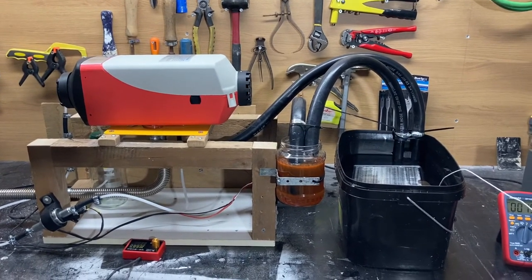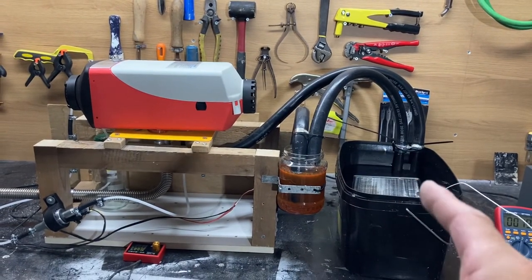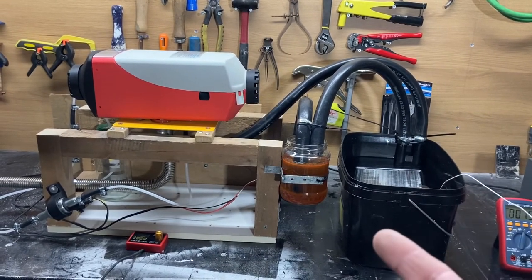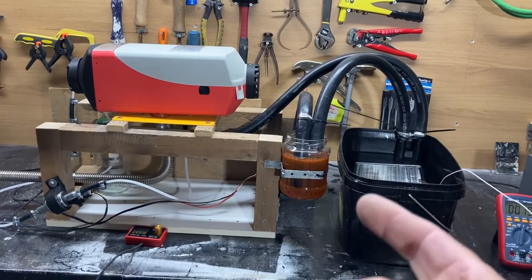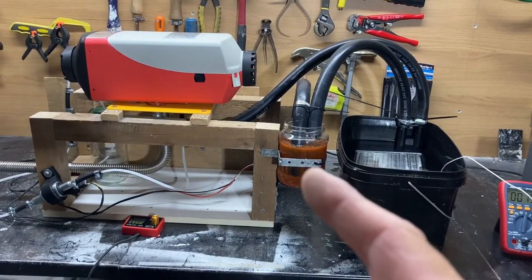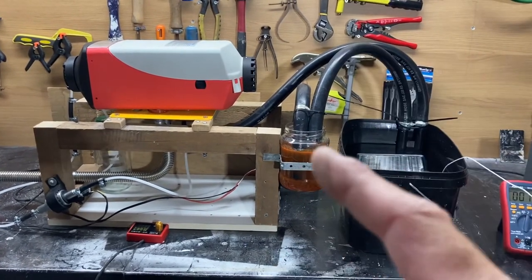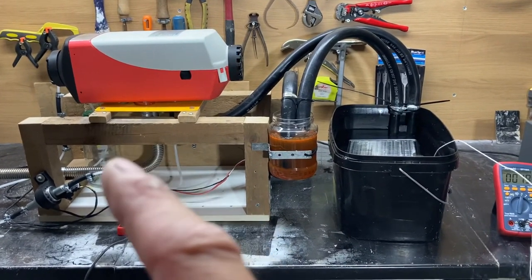Everything's set up correctly. So as you can see here, we've got all the proper pipes plumbed in. We've got the matrix elevated slightly so we can allow for convection of the water, the heat rising, the cold water going underneath, replenishing the matrix, shooting back up, going round as such. That's how I intend to heat my hot water tank up. This expansion tank was originally here, but because these pipes are not very flexible, it's better there. I need to put the diesel in there first as well. I've forgotten to do that.